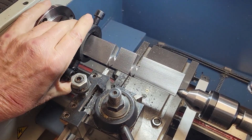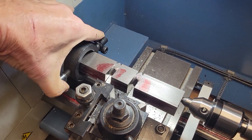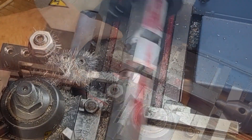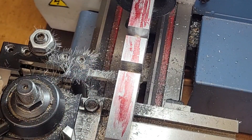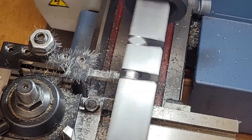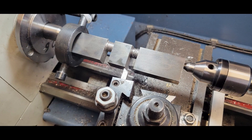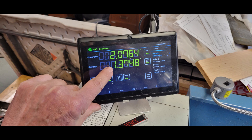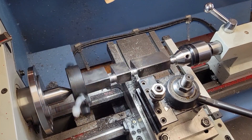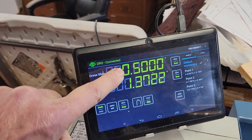I load the left-hand tool first and finish two of the crank web sides, then switch to the right-hand tool and rough out the other two crank web sides. Then I rough out the journal itself, bringing it to within 50 to 25 thousandths of final dimension. Notice how these chips are magnetized and click on the tool holder — they make nasty splinters. The two crank pin journals are identical and are one and three-eighths of an inch apart. When I'm happy with the size of the crank webs, I move to finish the crank journals themselves, slowly approaching my 0.5 inch diameter.